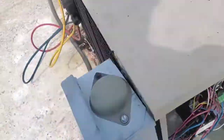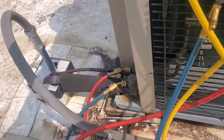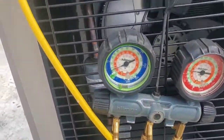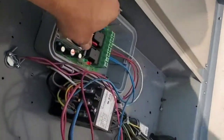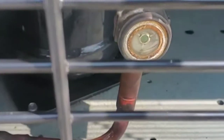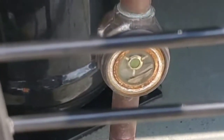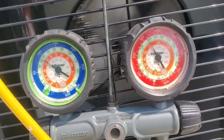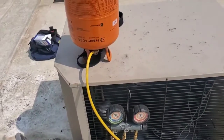Check this out — put it in defrost. Now the liquid from the tank is going straight down the liquid line into the evaporators and then into the compressor. I'm going to close that valve off, take it out of defrost. The system has an incredibly high heat load on it right now. It's about 90 degrees down in that walk-in cooler.